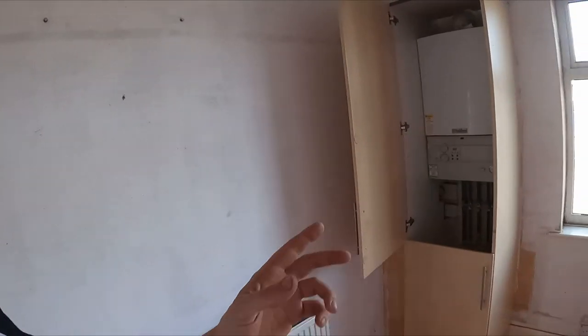The en-suite upstairs in the loft will be run off the boiler, but I'd recommend also having an electric shower so if one packs in you can still have hot water and a shower. The boiler is going in the kitchen, so make sure that's on our plans as a designated feed. Check for water, gas, oil - anything you need to run a bonding cable to, and note its location. I've caught myself out pricing bonding thinking it's very close, but the gas meter was outside the front of the house - what I priced as 30-40 minutes ended up being a three-hour job.